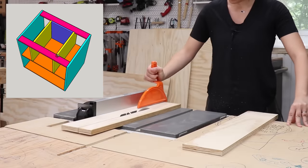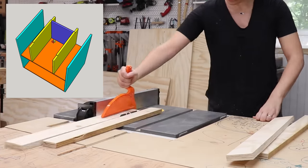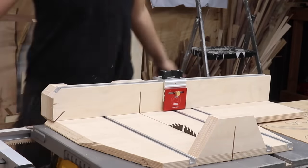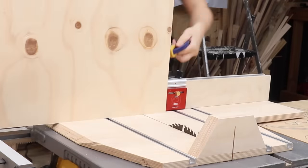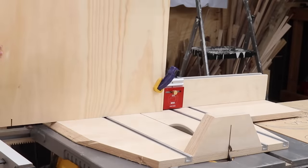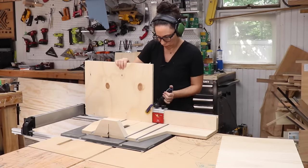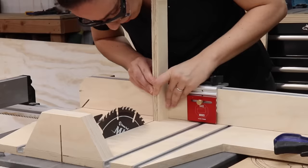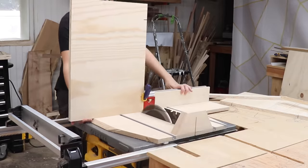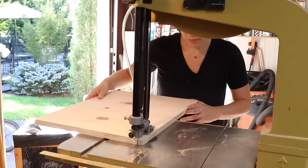The top of this whole cabinet is going to have these three-inch wide stretchers that will run across the whole top, but the center dividers need to have a little notch cut into them so that they will fit those three-inch wide stretchers. This is easily done at the cross cut sled using some stop locks. I just line up the three-inch wide piece with the kerf on the sled, set up the stop lock, and make the cuts on either side. The only problem is that I couldn't lift the blade high enough to cut the whole three inches, so I trim the rest at the bandsaw.